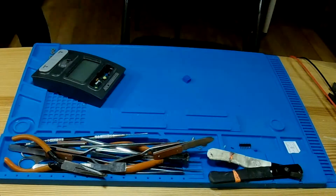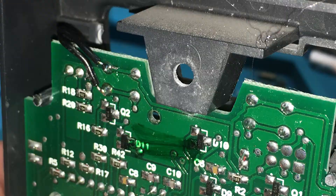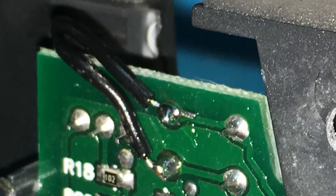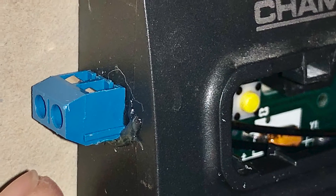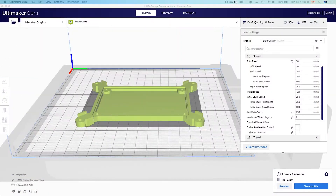The next step was to hack the garage controller by soldering the microswitch and installing two wires on an external screw terminal that I can use to jump with my controller.